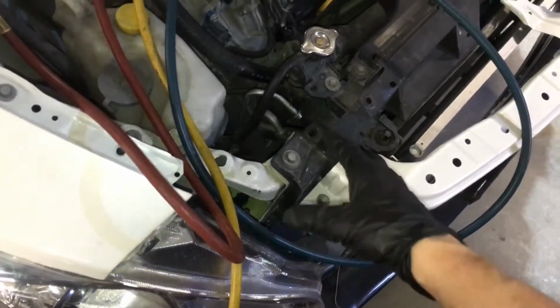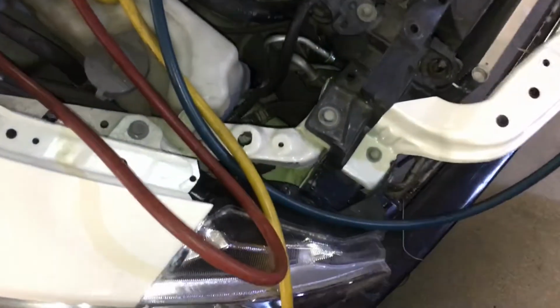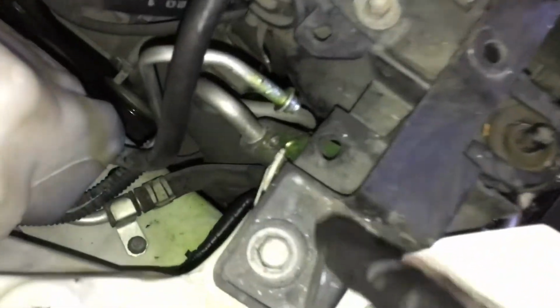When they got up the next morning, there was refrigerant oil and there was 0 refrigerant. It was flat, AC didn't work, and I came out here, gauged up, it was still flat. This is one of those, oh, and this is what else you could see.